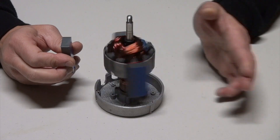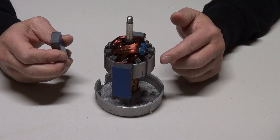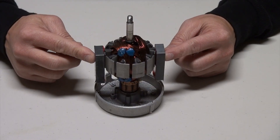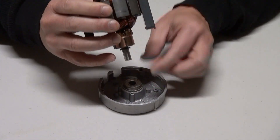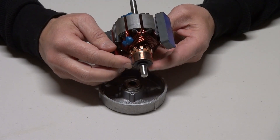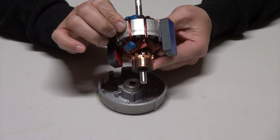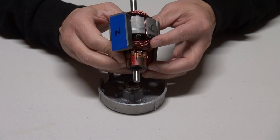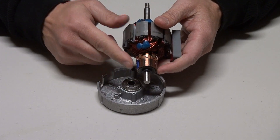The movable part — which is the rotor — will rotate. When this pole pair forces the interaction to rotate, it moves and forces the commutator plate to move, which then provides contact to the next pair of the rotor assembly. The process continues over and over again, especially when you have continuous current coming through.